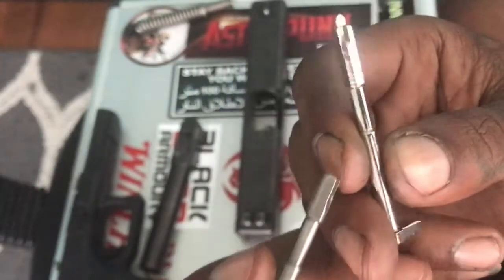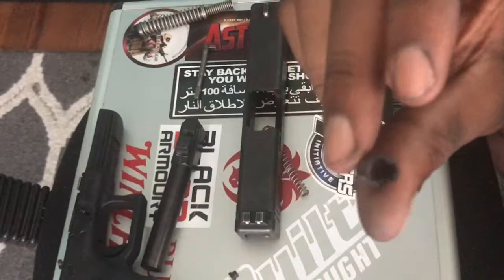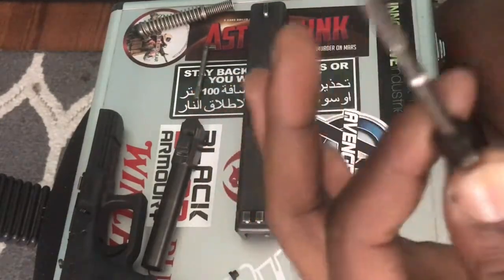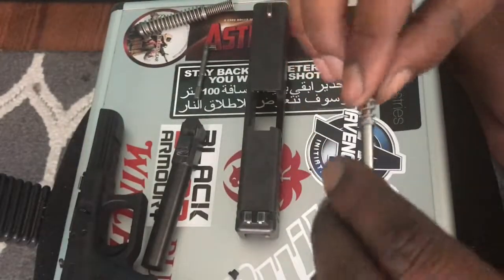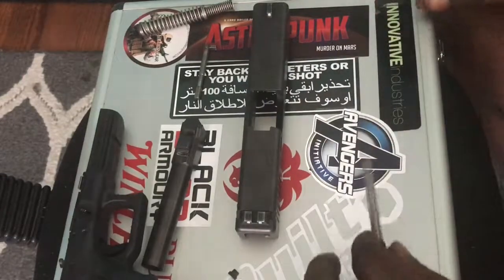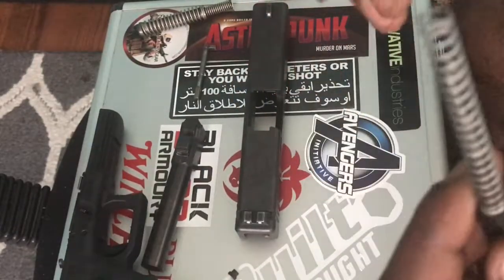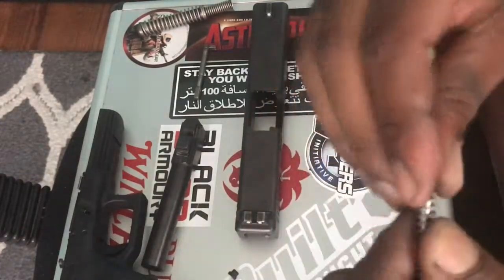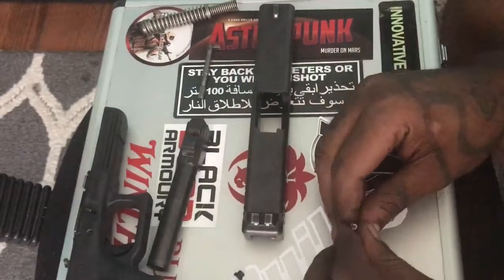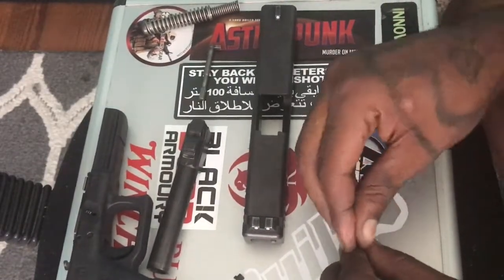Great polish on the new one — he's gonna be really happy with the way this thing works after I put it in. To put it back in, take the plastic round sleeve that has a crucifix cut into it, slide that right in and hold it with your thumb. Slide your spring all the way back on. The tricky part is getting the c-clips back in while managing spring tension. Pull down the main spring — that's what your firing pin works off of — and push down against something hard to compress it.